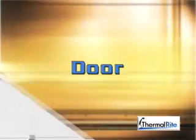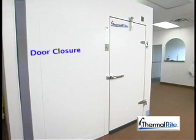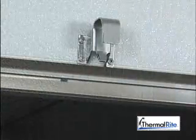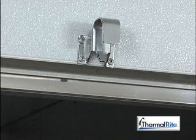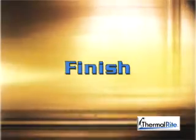Next, let's look at the pre-hung Thermalrite walk-in door. The flush mount self-closing door comes standard with a door closure, one spring-loaded hinge, deadbolt handle, and magnetic gasket to ensure a tight seal. The door is framed with a fiberglass pultrusion, and the door frame panel has an aluminum extruded frame. Complete the walk-in installation with the following finishing work.